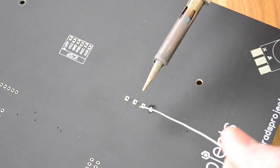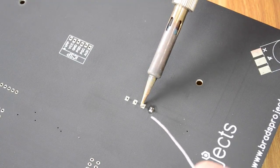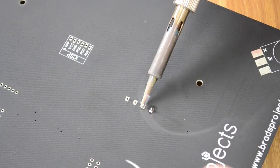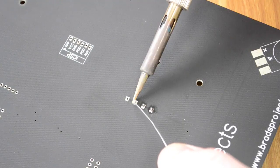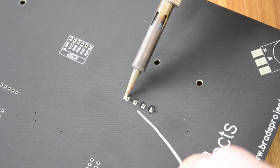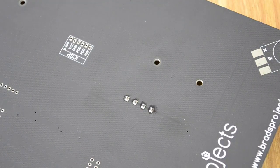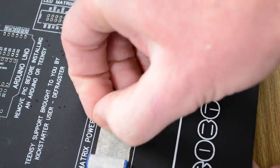To get the solder around every part of the pad and leg, just move the solder while leaving the soldering iron in place. Put the soldering iron in, let it heat up for a couple of seconds, touch the solder so it touches the iron, the pad, and the leg, let it melt, then put the solder on the other side as well. We just continue that process — a couple of seconds, touch all three, let it melt, bring some to the other side. Once we've done our first component, turn it over and take that tape off.